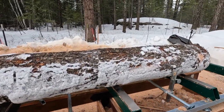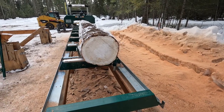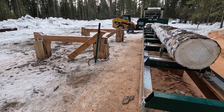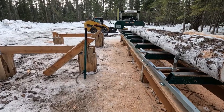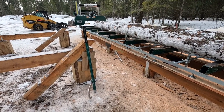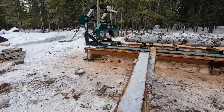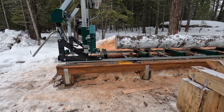I'm only missing a nine and a half footer, but I'll go ahead and make the beam full length. Let's see what I can get out of this thing. I definitely like having the log bunks here working by myself — rolling a log on the lumber mill with the skid steer just seems like you end up banging things around, whereas it's more controlled when you're rolling the log across. In the long run, there'll be less wear and tear on the sawmill and it's safer for me too.